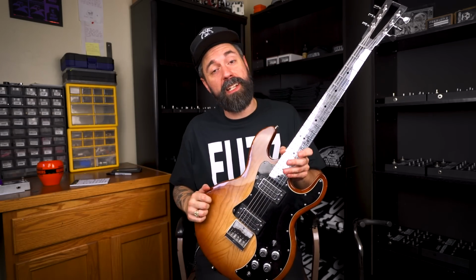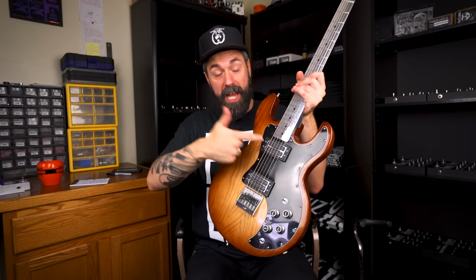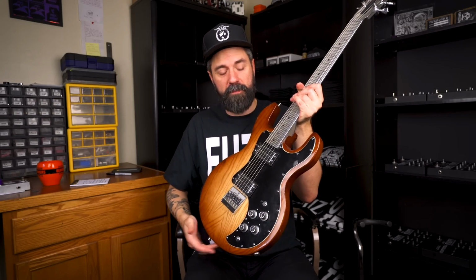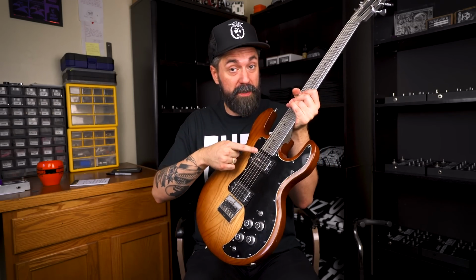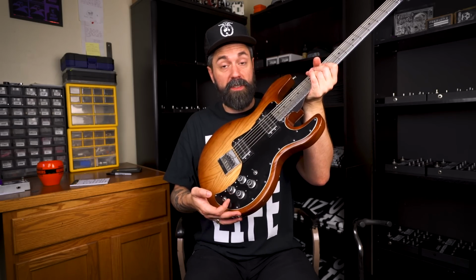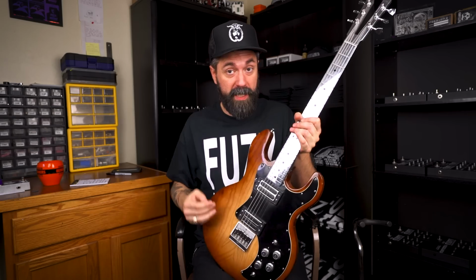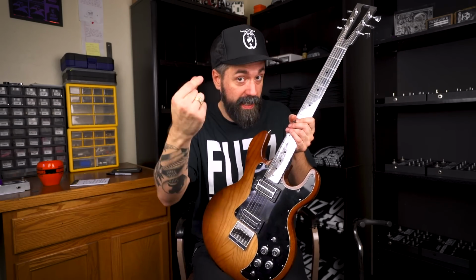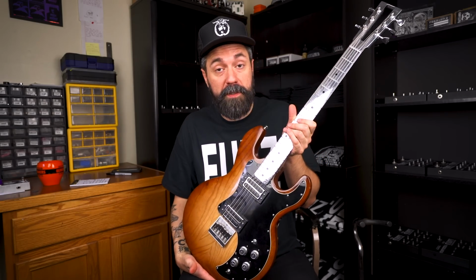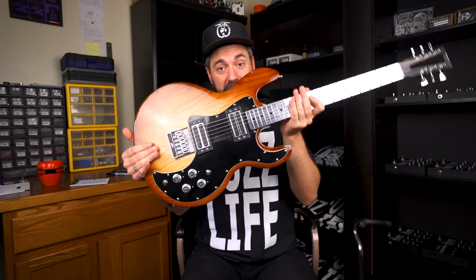Again, one more time, because that's really kind of a weird concept. We have it in the neck position, for example. Volume's all the way up, and the tone control's all the way up. This would now be a single coil pickup. Turn down the tone just a little bit, it'll take off a little high end, from about 10 to 7. From 7 to 4, we'll notice it gets a lot fuller sounding because we're blending in the second coil, making it a humbucker. From 4 to 0, it just dumps all the treble to ground, and it sounds like a normal tone control. So that is the coolest thing about the electronics of this guitar.